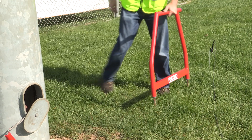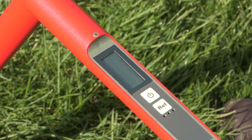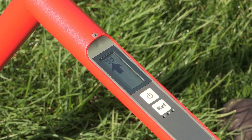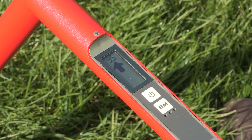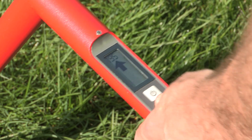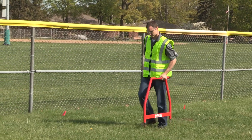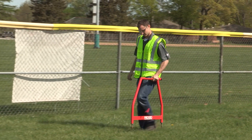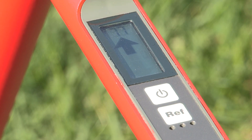Now you can use the A-Frame transmitter and receiver to pinpoint the problem. Place the A-Frame receiver between the ground stake and the transmitter connection to the conductor and turn the receiver on. The signal strength appears on the receiver display and will be highest near the ground stake and at the faults. Press the REF button to store a reference signal strength near the ground stake. When you reach the fault, you should see a similar value. Lift the receiver from the ground and move along the conductor path in the direction indicated by the arrow and the beeping.